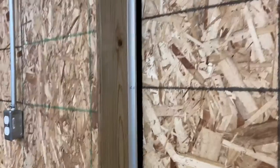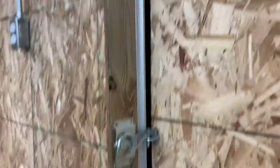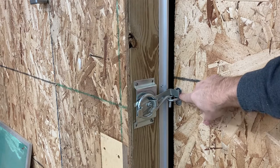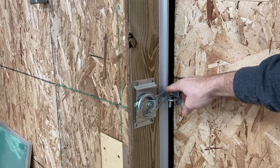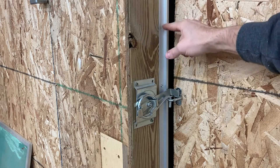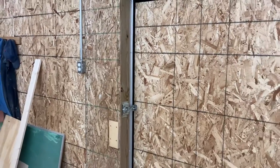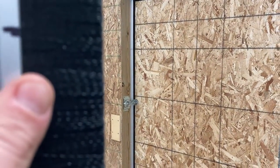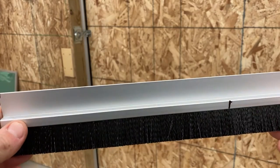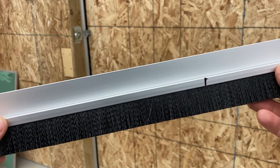Going along the outside, that corner transition was a little tricky but it's in there pretty good. I have these little cam latches — I had to move my latch inside just a little bit, but that brush just brushes right along. The lock was right by that and you just push it up against there and put screws in. I've got a couple more screws to put in but I'm real pleased. All you do is keep pushing that brush across and fastening screws. The frames are aluminum and they send you self-tapping screws, so you can pre-drill or just push it up against the door and screw it tight.